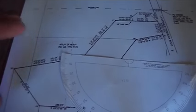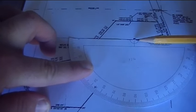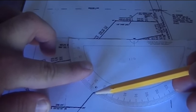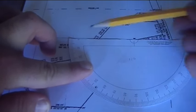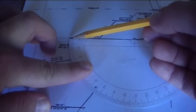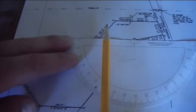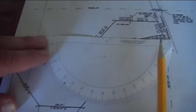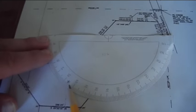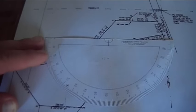Now this is very crude but it's effective. This protractor, when I line it up on the line that I've drawn and put the center point at the center of my protractor, I can look at where my property line comes across. With the way that the protractor is set, it's showing me right at 54 degrees. Now that 54 degrees is based off of zero on the protractor, but in reality my compass is going to show me that zero is straight due north. So we have to do a little bit of math — working backwards, counting up to 126 degrees on the protractor side, then adding the 90 degrees we lose from being straight north, which comes out to 216 degrees.